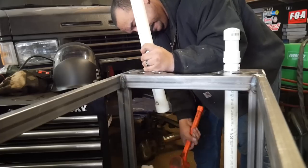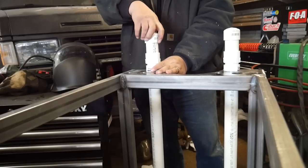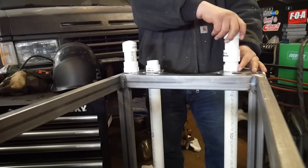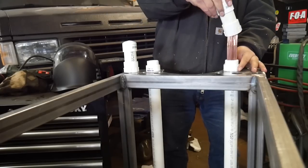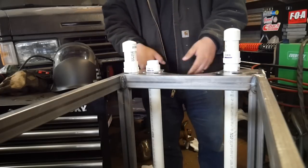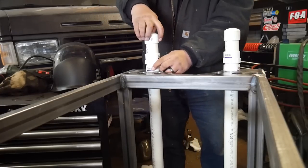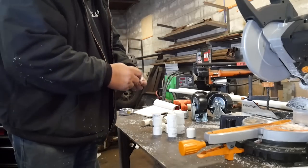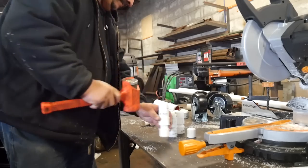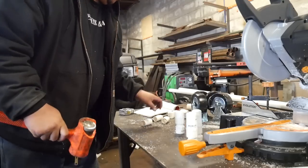I'm assembling the cap here — a little screw-on deal. Then you've got the bottom cap for the other one. We'll walk over to the cart to show you how that goes on — tap it on with the mallet, that's very important or they won't fully seat and they'll come apart. I'm going to be putting a two-part epoxy to hold the tube as well as that threaded cap. On one side we'll have 1/16th and the other side will be 3/32nds TIG rods. In the larger containers we'll have mild steel rod, and in the smaller ones we'll have aluminum, stainless steel, and silicon bronze.